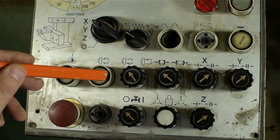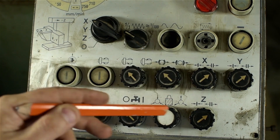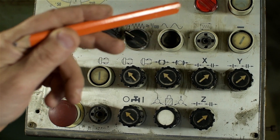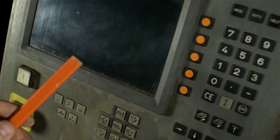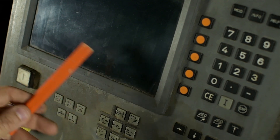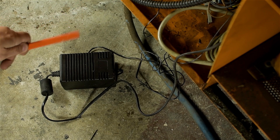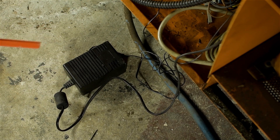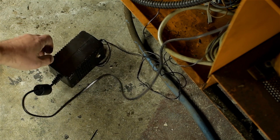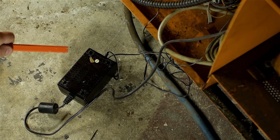The hydraulics are working, spindle direction works, coolant pump doesn't seem to work, the power drawbar seems okay, and it's got some sort of spindle brake — this also works. It's got lockouts for X, Y, and Z. The motion control — feed rates, rapids, spindle speed override — I haven't been able to get any of that to work. The controller even worked; the screen came on. I got CNC-ish menus in German. It worked in that I was getting DRO feedback on the screen when I moved the machine handles around. Unfortunately, that didn't last long. Fifteen minutes into trying to figure out how to change the language on the controller, I heard a pop and this power brick started spitting out a lot of smoke. It was still sort of wet. This doesn't appear to be OEM to me, and I'm sure if I found an equivalent power brick I could power that thing back on, but I'm not going to burn too much time with that old controller.